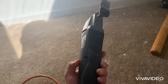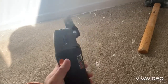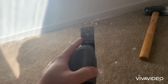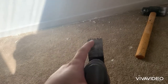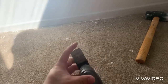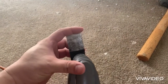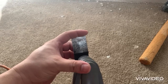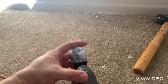Let me further clarify what I meant by using an oscillating tool. This is a drywall blade. When it's brand new, it has factory cut teeth in it. After you use it for four hours, the teeth wear away and then you have just a dull rectangular blade with no teeth. That is what I meant when I said use a dull drywall blade.